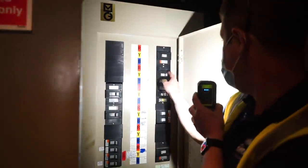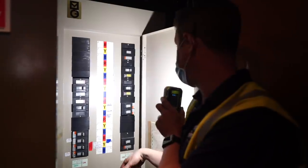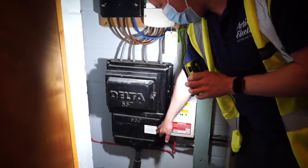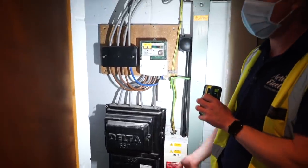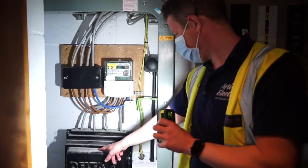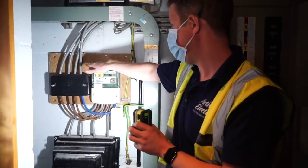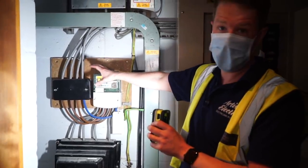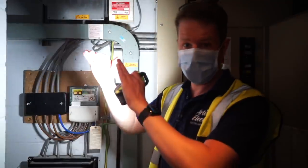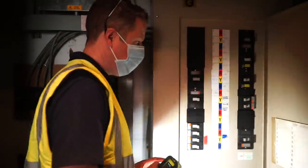This distribution board is fed by a cable going to an MCCB in the panel next door. The MCCB marked as spare gives us a 100 amp three-phase supply to that board — perfect capacity. The main incoming supply is PME (TN-CS), so normally you'd need earth rods and PEN fault detection devices, but because we're installing Zappies we don't — it's all built in. The main fuse appears to be 100 amp three-phase for the whole building. We'll run CTs here to monitor building power consumption, and if charging risks overloading the main cutout, the Zappies will automatically ramp down to prevent blowing the fuse.